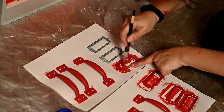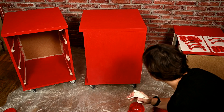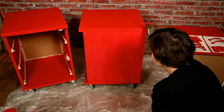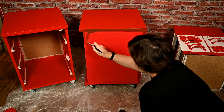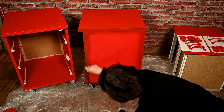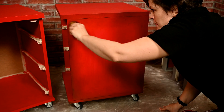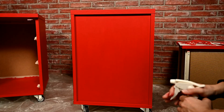I'm leaving them to dry for at least a day, and then I'll edge the cabinets using a blending technique. I've already used this technique for smaller projects but only with chalk paints before — this time I'll test it with ordinary water-based paints. I'll use a second color, and it is brown. First I'm spraying the surface with water so the paint dries less quickly and blends better over a wet surface.